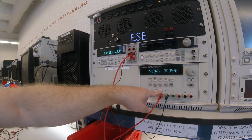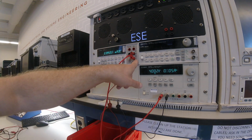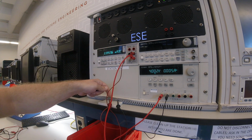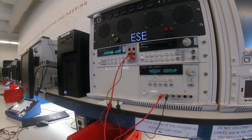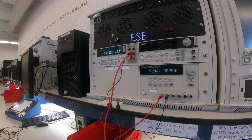So I have current once again leaving from the plus 6 volts, going into the input I of the DMM, coming out of the low, going into my resistive divider, going through the series resistors, and then back to the ground. And you'll see that I have 3.96 milliamps DC, which is very close to the 4 milliamps that we expected.